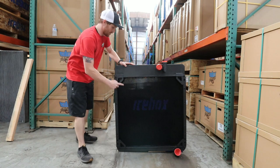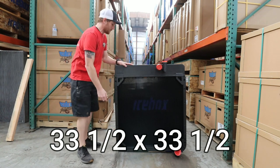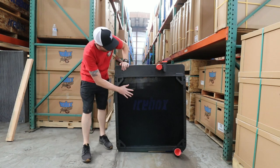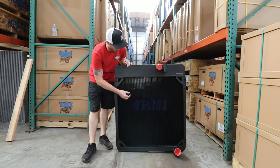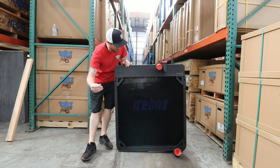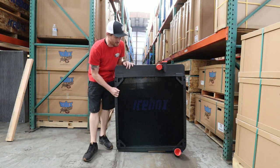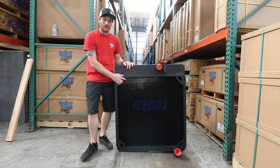This unit is going to be 33.5 inches from top to bottom, 33.5 inches from left to right. It's got those heavy-duty steel fins on that core, with wider fin spacing to help with dirt or debris to keep it from plugging up in that core. It also makes it much easier to clean out when it does eventually get plugged up.